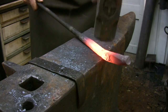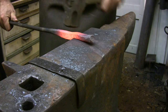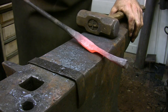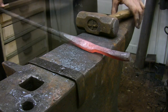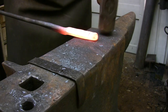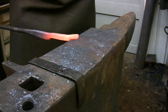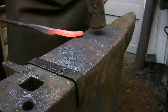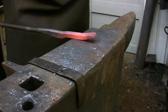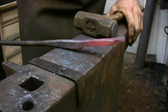This section is forged out exactly the same way as for the flat bit tongs. With this heat I'm going to finish shaping the flat section of the tongs and define the offset that's going to be used for the actual bit. If you're new to making tongs, take the time to use the ruler at the anvil to note where the offsets are lining up. That way when you make the mating piece you can get things to line up before moving on to the next section. This is going to be the last time you'll be able to make any adjustments to the size of the bit.